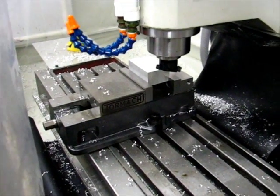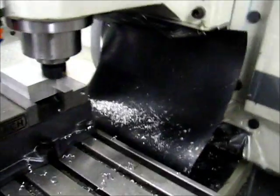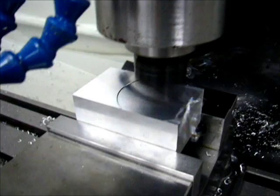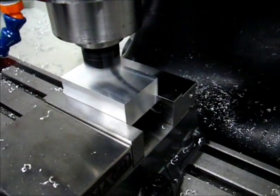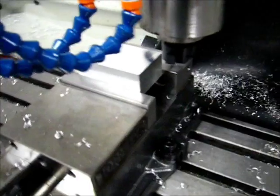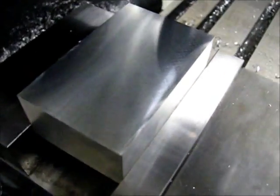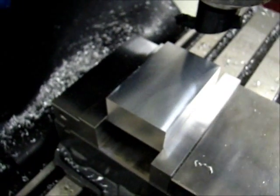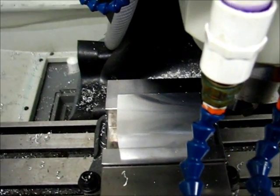All right, here's the right to left cut with a 10,000th shim stock underneath the right front foot. From over here, from this side at least, it looks like the cut is going both directions. It looks pretty reasonable from here as well. Looks like a good crosshatch pattern there. See if I can get it in a light that looks reasonable. I tell you, it's just difficult to see going this way. I'm not sure why. Anyway, let me do the left to right cut next.